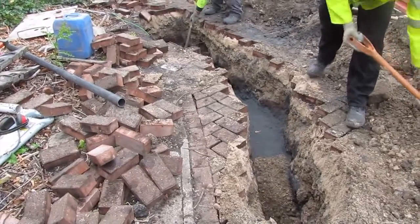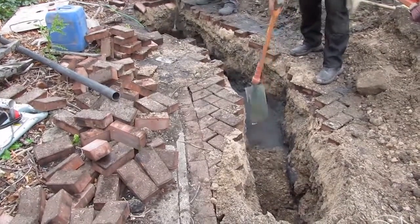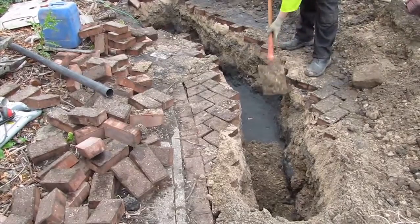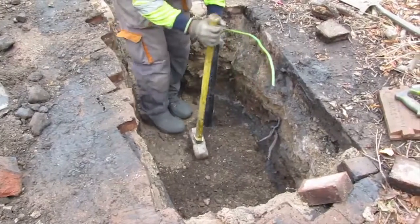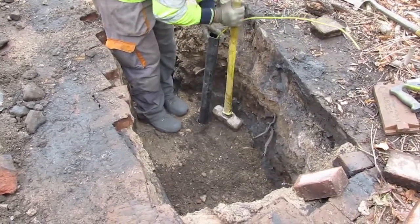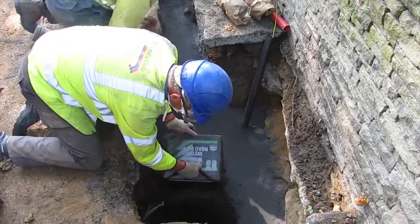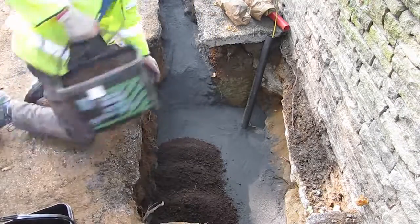With a hand shovel, slowly and carefully place a layer approximately 100 mm deep of earth free from stones from the excavation on top of the concrete, taking care not to disturb the electrode and duct. Lightly compact the backfill. Subsequent layers of backfill can then be placed onto this layer to the specified depth and compacted using a hand tamp. At this point, the contractor should take a photograph for internal audit purposes.